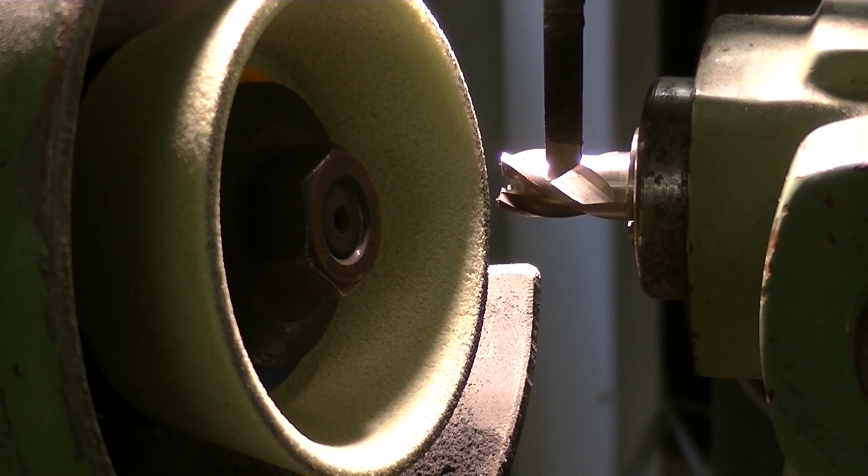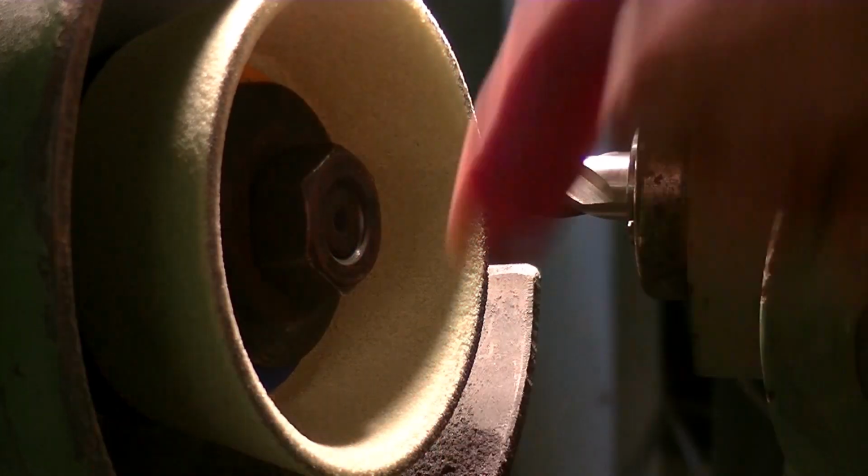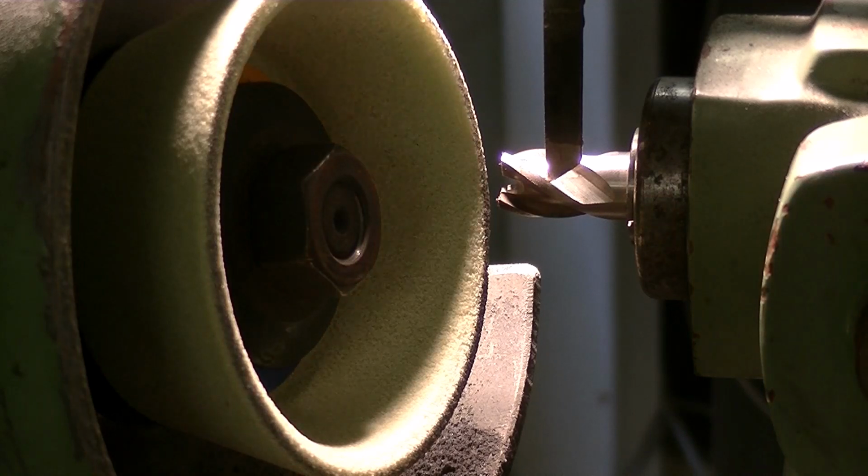Back to my old friend the Rongfu tool and cutter grinder. A little bit more explanation about indexing. All of the articles that I've read on grinding high-speed steel tools say that the direction of the wheel should be down onto the cutting edge, or grinding onto the edge. That way you don't create a burr. If you grind the other way around and have it trailing back towards the edge, you can create a wire burr along the edge that will break away and it leaves what's called a fritted edge, which gives you high wear.